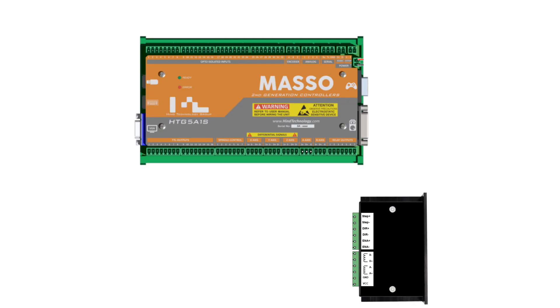So next I'm going to show you how to connect a differential drive in common ground mode. On your stepper motor drive, connect together the step minus and direction minus terminals — this creates a common ground. You can now connect this to the ground terminal of MASSO. Take the S+ and connect that to the step plus of your drive, take the D+ and connect that to the direction plus of your drive. Just like with differential drives, never let the step, direction, or ground terminal come in contact with each other or any powered terminal on MASSO, or you'll end up damaging the drive.